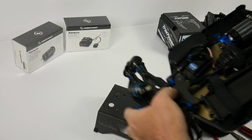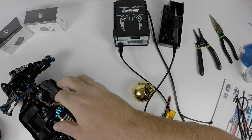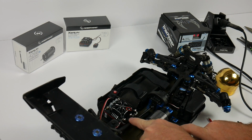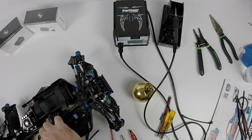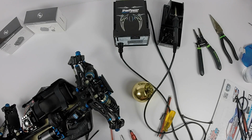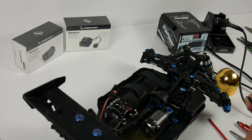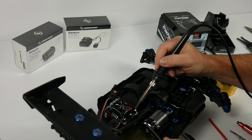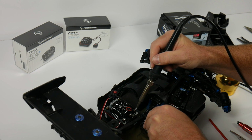We can get rid of the monster truck tire now and the 8 scales, but we may need that later on when we attach the actual wires to the motor. So you can just get rid of some of the little bits and pieces of rosin that you may have laying around from soldering and stuff, just getting everywhere. And we can go ahead and take our pre-tinned pieces here and go ahead and get our solder on. So this is easy. Pretty much heat this stuff up. Love these big posts here. Lay this on there.